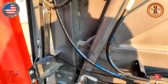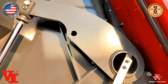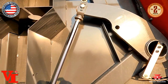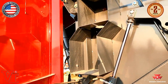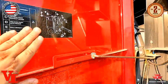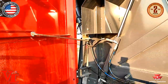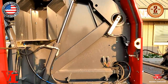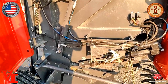Dual cylinders on both sides. You have a cylinder on the right-hand side here that's going to be pulling on your forming bale rack. As the bale grows, it's going to put pressure against this as it grows, and you're going to have equal tension on both sides of the bale. Two balls of twine on the right side, two on the left — so you've got four total balls and you're putting that on at twice the speed. Right here you have your chart that's going to show you your lubrication points, but it's very simple — they don't have a whole lot going on on the right-hand side. Makes a super nice easy baler to operate and to work on if you need to maintain it in the future.